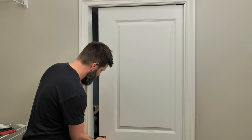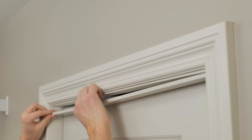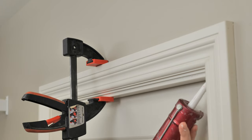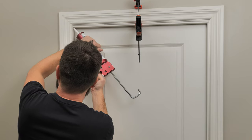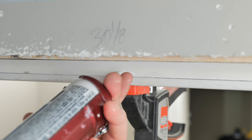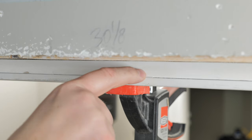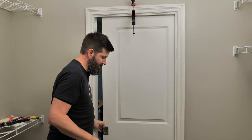While we're here, check the back roller as well and make sure it's good. Close the door — that's the hard part done. Now put the trim back up. You can nail it, but then you have wood filler and paint touch-ups. Instead, use a little bit of DAP caulking — put a little bit at the back seam too so it doesn't fall down. Just a small dab, smooth it onto the seam, and clamp it. After that dries, the pocket door is good to go.